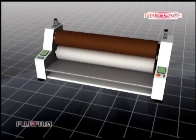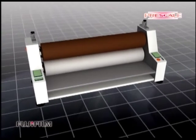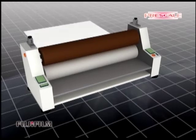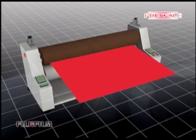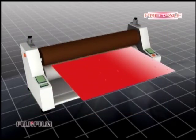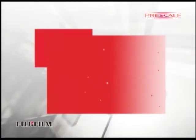Take a look at how Prescale is benefiting the paper or film industry, whether nip roller application involves heat sealing or heat rolling. If nip roller contacts are consistent and the pressure is distributed evenly across the wide area, Prescale can display the consistency and stability of the pressure density. This is a good sample for stable density of Prescale. If nip pressure balance is not good or there is any dust or inconsistencies, a gradient chart or some spot dust will be displayed on the film.